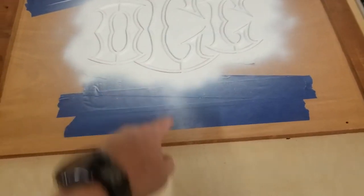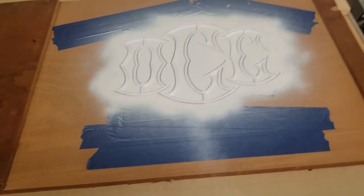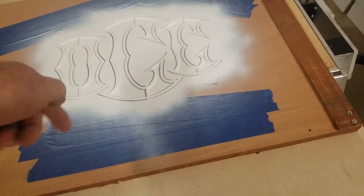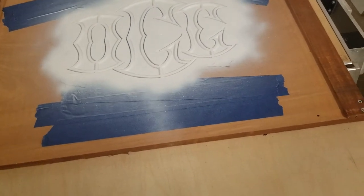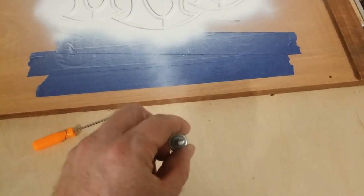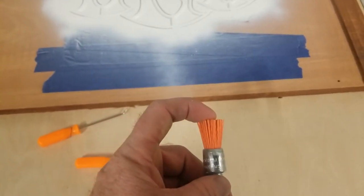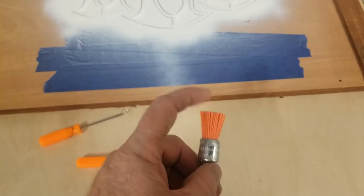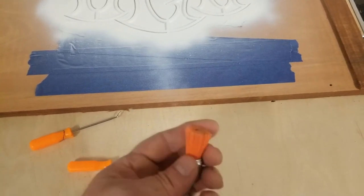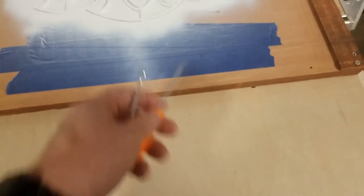There are still some lines because I need to sand it down and take the paint off. I had either 150 or 180 grit on the five-inch pad — just knocked it down to remove the fuzzy edges from the V-bit. Then I went through with a Nylox sanding setup — they come in different abrasion amounts and different sizes and shapes of abrasive strings.